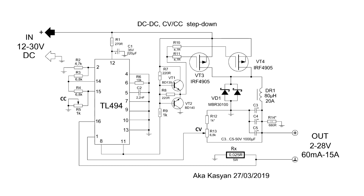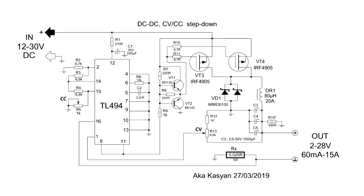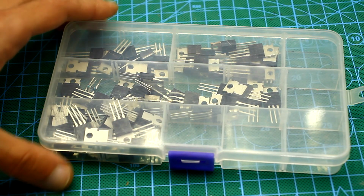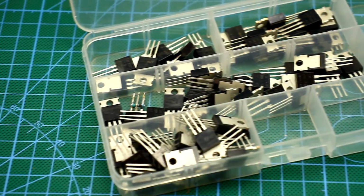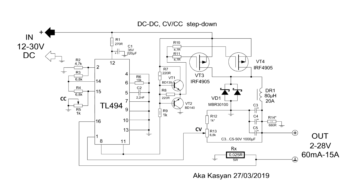The unit is assembled on the basis of PWM controller TL494. The output of the chip is supplemented with a driver. In fact, it is a current amplifier and is designed for correct control of power transistors. As already mentioned, FETs are used, a couple connected in parallel to increase the power. The snag is that these are P-channel transistors and many may have problems finding them, since they aren't so popular as N-channel transistors. If you have a radio shop in the city, then there will be no problems, but in my town there are only the local hucksters who didn't have P-channel FETs with the desired characteristics.